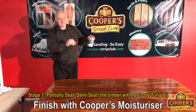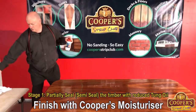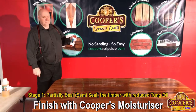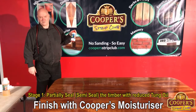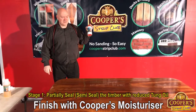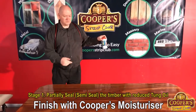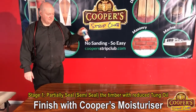However, if I wanted to add a bit more colour in a more subtle way, I would add this stain to the oil — put about 5 to 10% of this into the oil. This is a spirit-based one. When it says NGR it means non-grain raising. So we put some of this into the oil, we brush this on, and then it's a nice subtle way of adding colour where it doesn't look obvious — it looks almost like it was real. In this case, I like the colour it was when it was stripped, so I left this out.